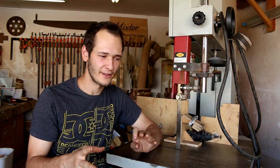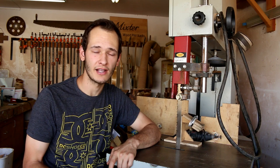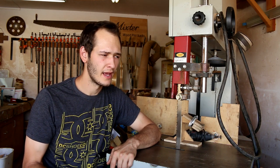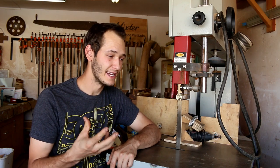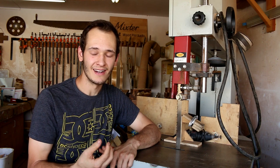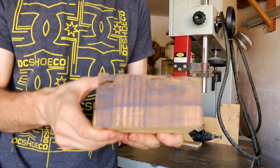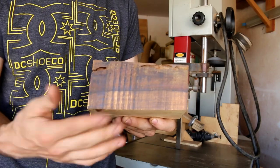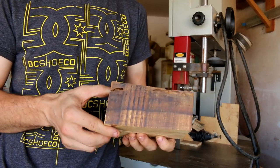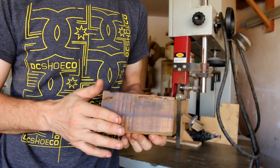Back to the subject at hand. I like to sharpen my bandsaw blades about every three to four hours of cutting ironwood, and that's pretty much a requirement because after a while the blade just won't cut anymore without burning. It'll leave really disgusting marks on the wood. You can see every quarter inch or so it'll burn, and that's not good — it puts a lot of strain on the machine, heats up the blade, decreases the life quite a bit, and makes a pretty disgusting cut.